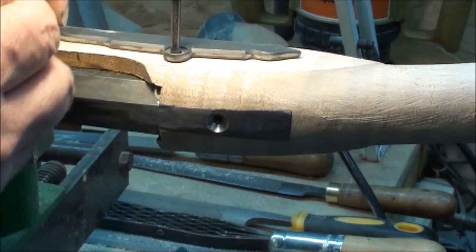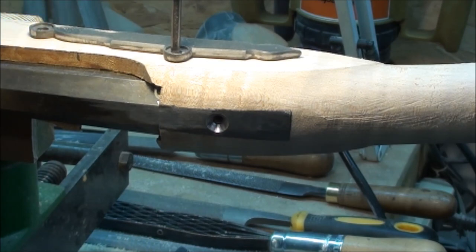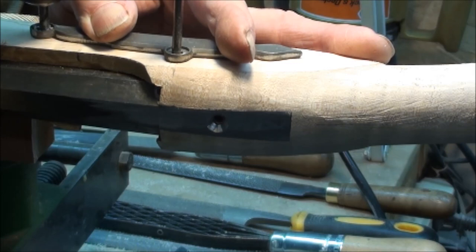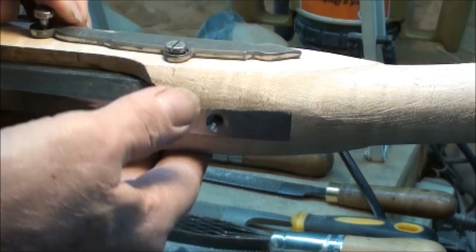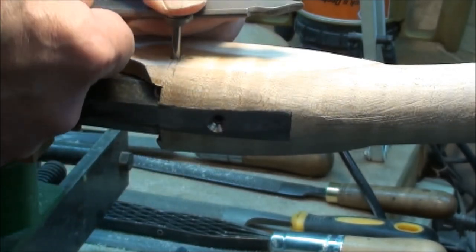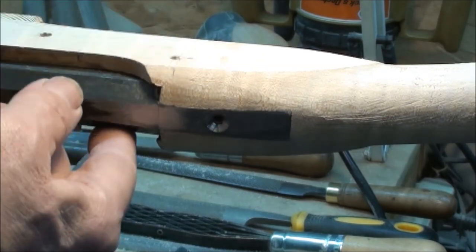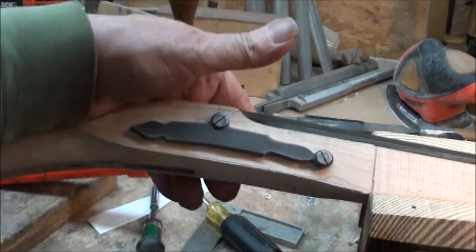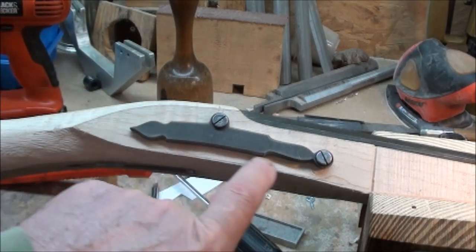Now I can check my holes to make sure everything came out right. Drop a bolt down this one and down the other one — everything should line up. This one's a little bit off, but easy enough to take care of. Now those bolts will line up with the holes in the plate. I'll simply put the plate in place and run my taps from this side down into the plate — that way it makes sure everything's lined up properly. There's the side plate all set in place, holes drilled, tapped into the plate, and locked down. Now all I've got to do is scribe around this and start inletting it into the wood.